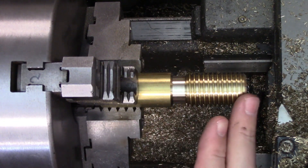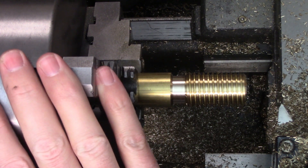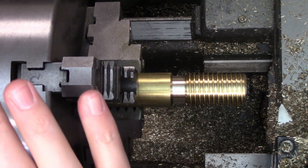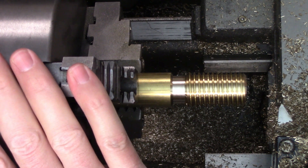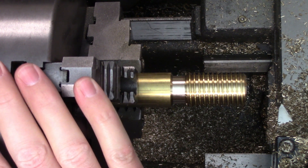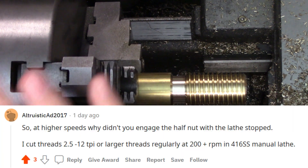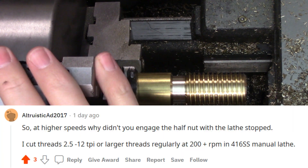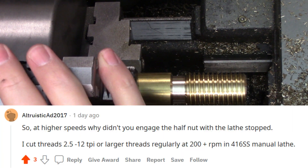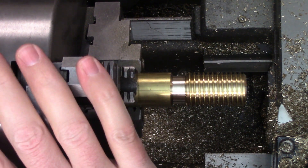I've got all of this cut at 75 RPM and it looks pretty much identical to my original sample. So now I've taken it out of back gear and it's back at 410 RPM. Now I'm going to do another suggestion that came from Reddit user altruisticad2017. He asked why didn't I just engage the half nuts with the lathe stopped.